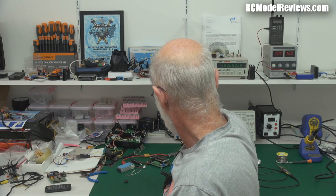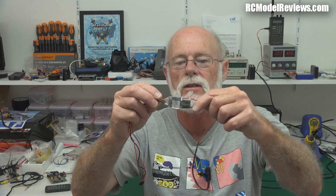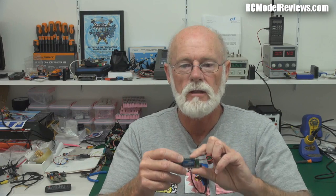In fact, I noticed some other manufacturers — here's another one, I think this one's from RC Timer. It doesn't seem to be made to quite the same quality, but it just has a lead with no ferrite on it. But it's actually lower noise — there's less noise coming out of this than out of the one with the ferrite toroid on it. So it's not what you'd assume; you can't always judge it by its cover. The noise out of switching BECs — it's not really an issue. I've used these Hobby King ones and they work just fine. 250 millivolts of noise on a 5 or 6 volt output gets cut off when it goes into your receiver or your servos through the voltage regulators. So it doesn't matter if your switching BEC is putting out a bit of noise — it really isn't going to be an issue. But then again, why would you want to carry around extra weight when you don't have to?